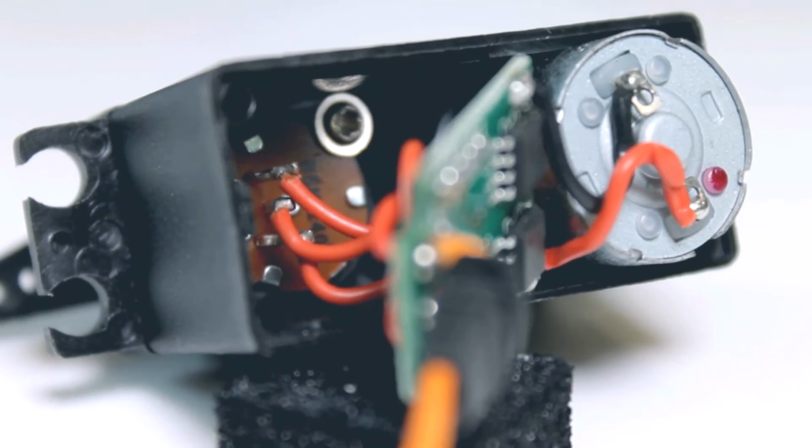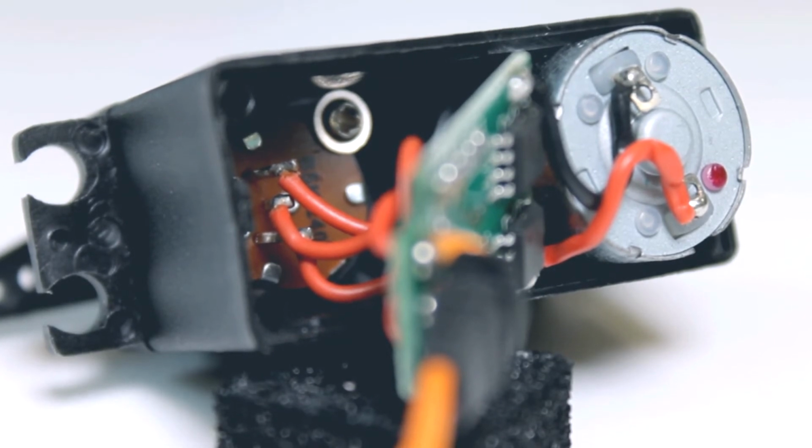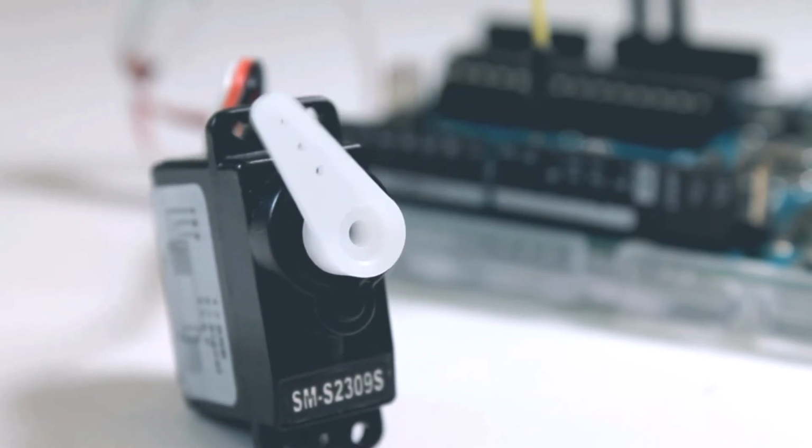Servo motors are modified DC or AC motors as they have added positional feedback built into them. Using a potentiometer to track the position of the shaft makes it possible to make precise movements. Most servo motors are limited to a 180-degree rotation angle. Trying to rotate the shaft beyond this range may break the servo. Also, continuous servos exist. They work in a slightly different way and allow for continuous rotation.